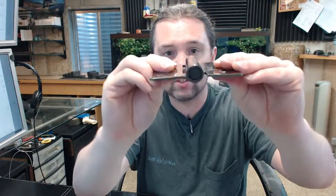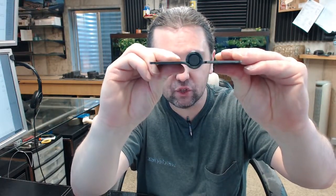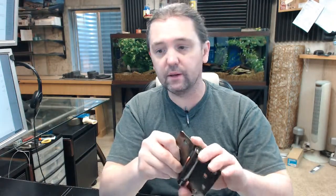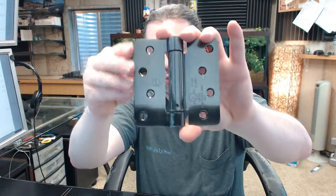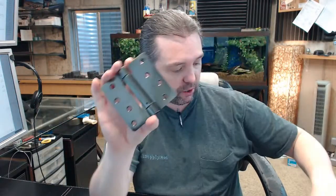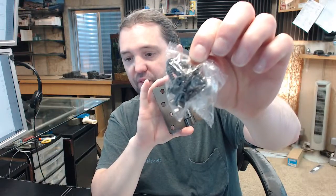This is a full mortise style hinge. You can see from the swag on the hinge leaf there that when the leaves are brought parallel, they're meant to be mortised flush to the edge of the door and to the frame. The thickness of the leaf is 97 thousandths, which would be considered residential grade. Again, quarter inch radius, 8 holes, screws are included, and a complimentary finish.